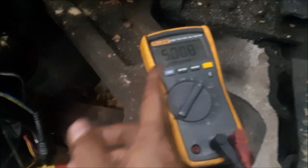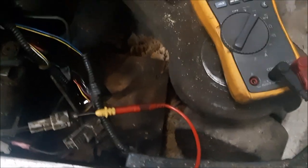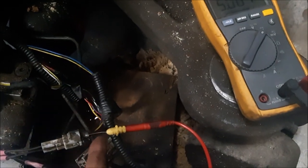So what should have happened is the pump should have created the pressure inside the accumulator, and then the switch would close, and that 5 volts should turn to 0 because it's going to be connected to the negative. So right now I'm having a code G3, right? So what we're going to try to do is simulate the switch